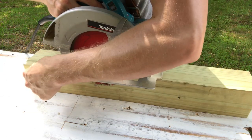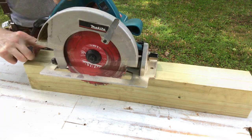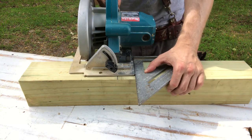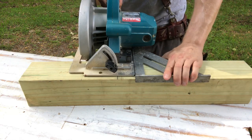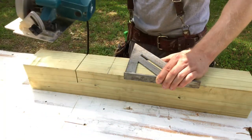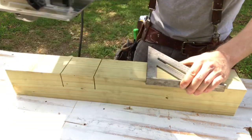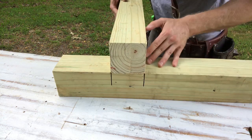I use that center line to set my circular saw blade by eye, locking it into place at that exact depth. With all these marks set, we're ready to cut. I like to make my perimeter cuts first. Lining up the point of my blade tooth with the pencil line, I use my speed square as a guide — pushing the edge of the sole plate up against the edge of the square. This keeps the saw perpendicular to the stock and I can run my cut straight through confidently. Try to split your pencil mark right up the center — it takes precision, but it can be done. When the first perimeter cut is done, just repeat the same process for the other one.